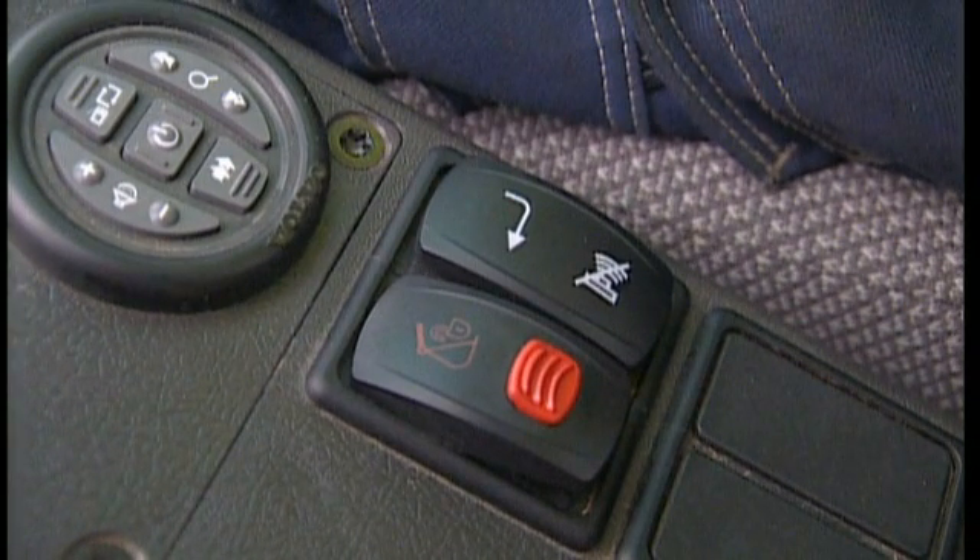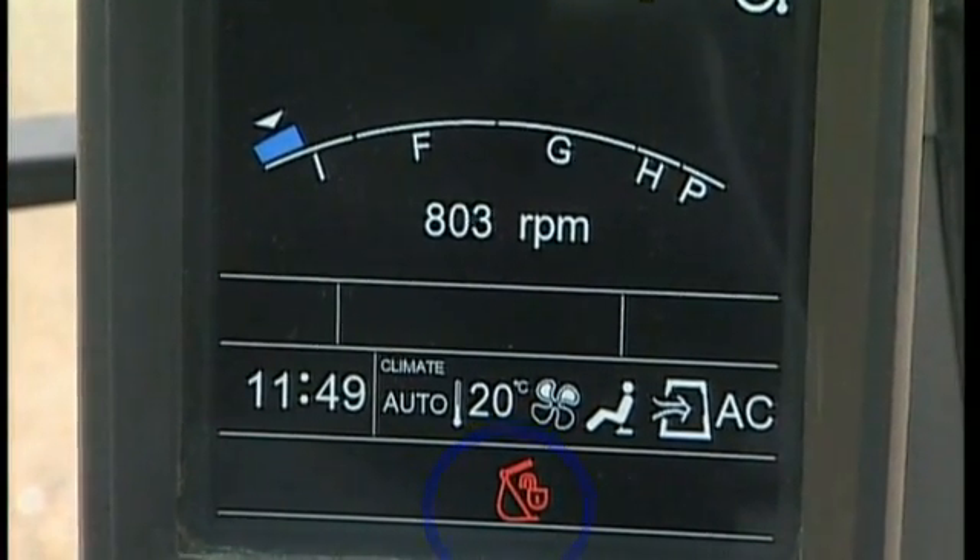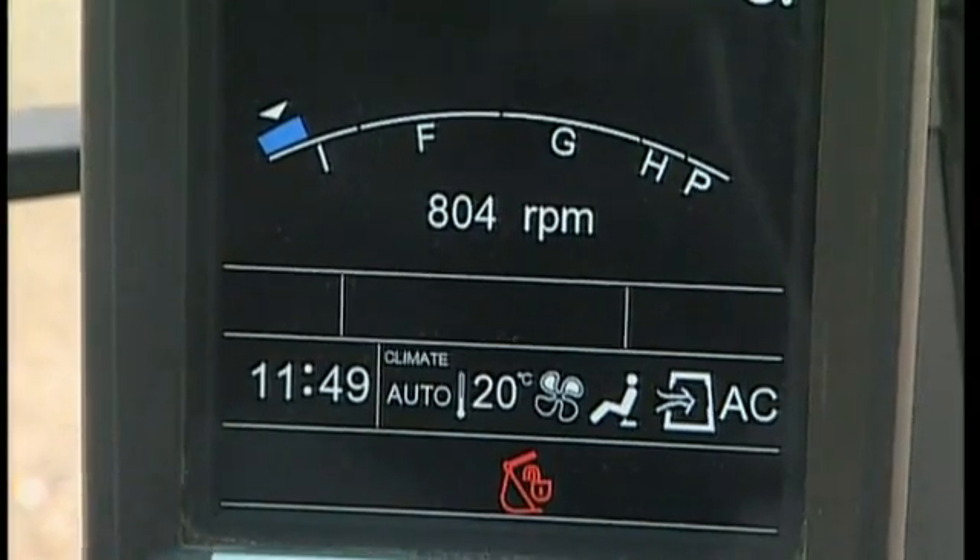As the operator, make sure this switch is always intact and functional. If you should touch this safety switch by accident, you won't lose the attachment because the switch is unable to move down. A warning symbol is then activated on the display, and a buzzing sound can be heard to warn you that the attachment is now unlocked.